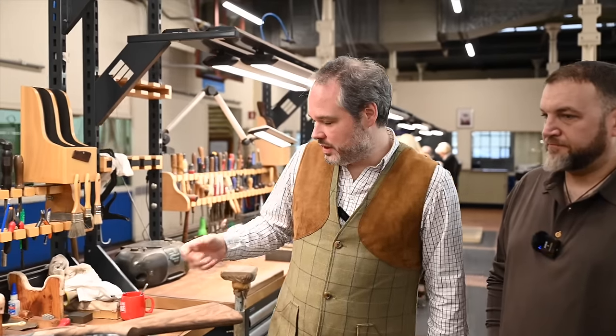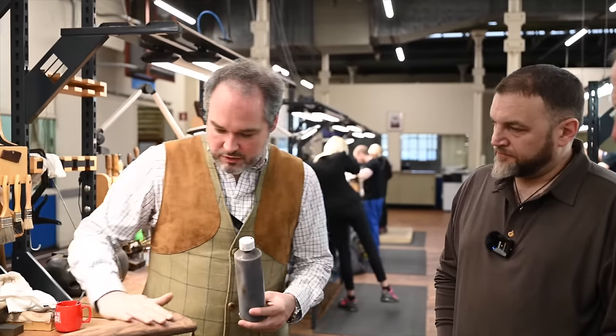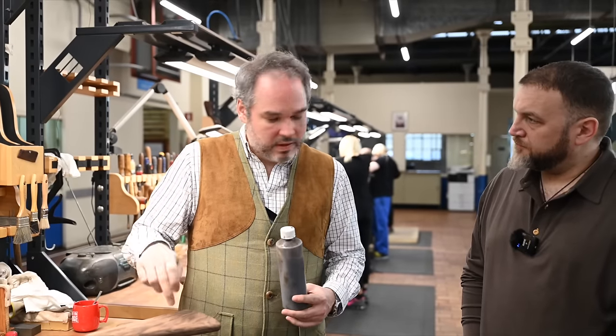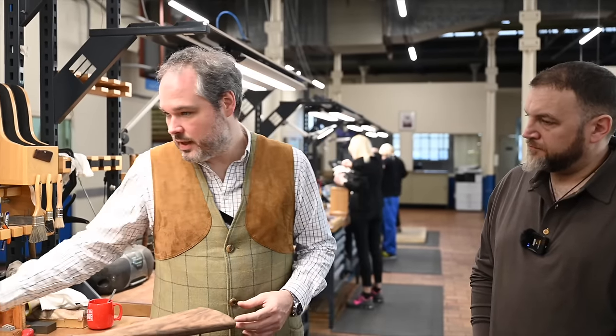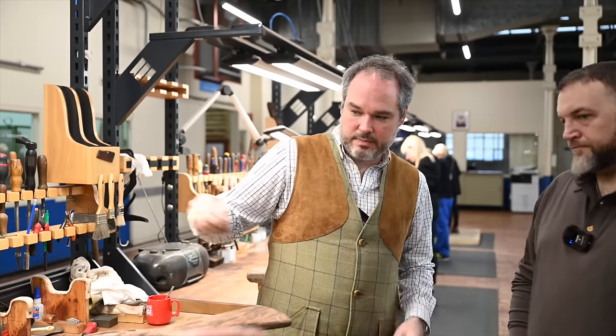So, as I said, after that, polishing, and then we will use a kind of grain filler, so it's a paste like that. We will put the first coat, then we will let it dry. We will remove the excess with sandpaper, and then it's a superposition of coats that will fill up all the grain. And that will arrive to a finish a little bit like that.